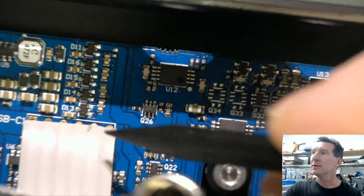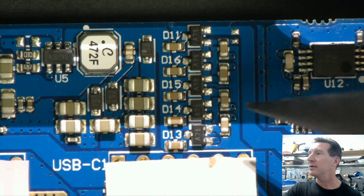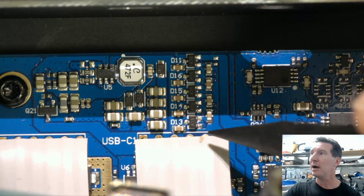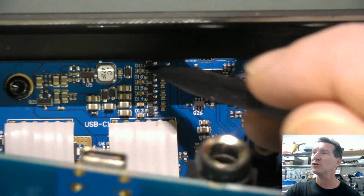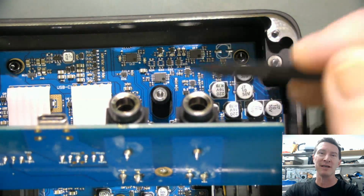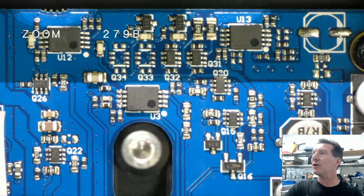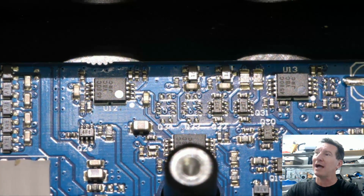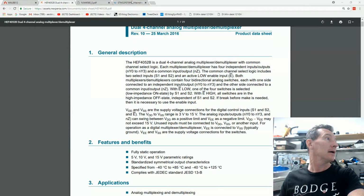Look at this. We've got ourselves a diode capacitor pump there, and that is multiplying the voltage up. So that's generating the 48 volts. You want to have it over here so then you can filter the crap out of it before it gets over to here. You don't want to have it close. Anyway, going down in here, we've now got some Japan Radio Corp JRC 4580s, and they're of course your standard op amp.